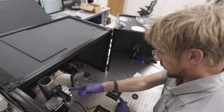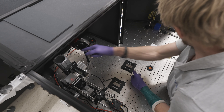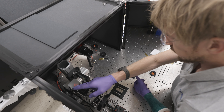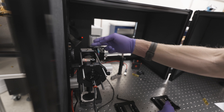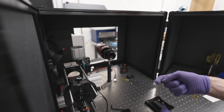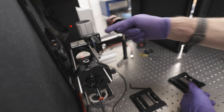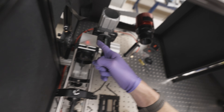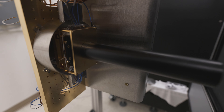The other half of it comes here. Some of it actually hits this face, comes back here, reflects off of this, and then passes through the system again. This is an optic that forms an image of what it sees. If this is a collimated beam hitting this, any scattering off the actual coating in the center — that light goes in all directions — the optic will make an image of it as well. Same thing with light coming to this surface: some of it doesn't turn to the surface, it goes right back. You can kind of get a sense of where the ghosts might be coming from based on what you block.